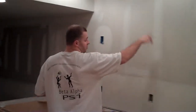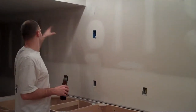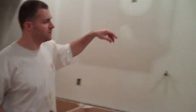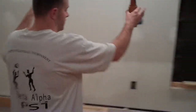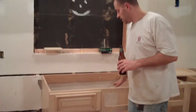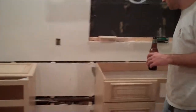36-inch wall, which will be coming to about here. 24-inch corner cabinet and then a 9-inch cabinet on the other side. Wall cabinet. So come over — you've got a 36-inch cabinet here. Window — put that in the spring — sink base, cabinet. I've got to take these off still. And then you've got your hookup for a dishwasher. Luckily enough, we'll just swing right around, so I don't have to do anything.